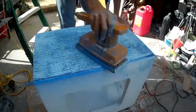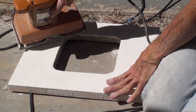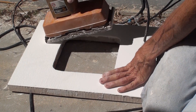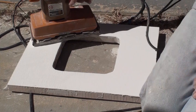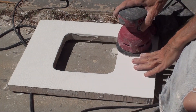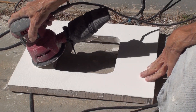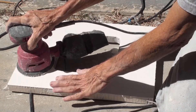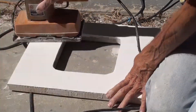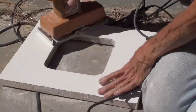This is a time-lapse. I actually laid in some blue on top of the white so you could see how I was sanding through, leaving white in the high spots. You never want to let your sander tip up on edge — you want to keep that sander flat. It's very tempting to let the sander sit up on the edge because it'll cut much quicker on edge if you're trying to remove a lot from a lump, but you will leave a hollow spot that you'll come back and fill in later and then sand again. Keep the sander flat — I learned this the hard way.